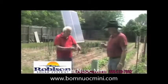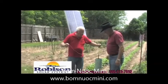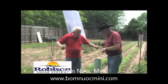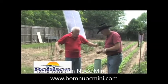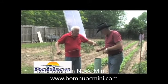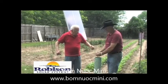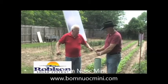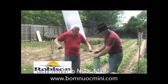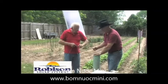First, we're going to show you how to hook up the pump. Dad has a weight fixed up on a string and we're going to let it down in the well. Let it all the way down — keep watching the bottom with a light, or here in daylight we can see it going down. It's touching the top of the water right now, so we'll tie a knot right here — that tells us just about where the water line is. Then we go on down with the string until it bottoms out, and hopefully we'll have 20 to 25 feet of water.